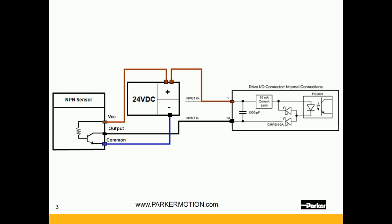Here's a different type of input — here we have a plus and a minus on the input. This is just one example of a manufacturer's input. There's a lot going on here: here's a capacitor that acts as a low-pass filter, here's a current limit similar to a resistor, and these two zener diodes are used for over-voltage protection.